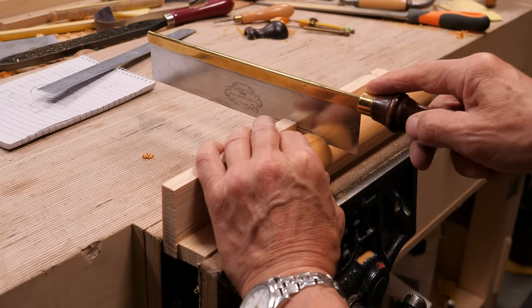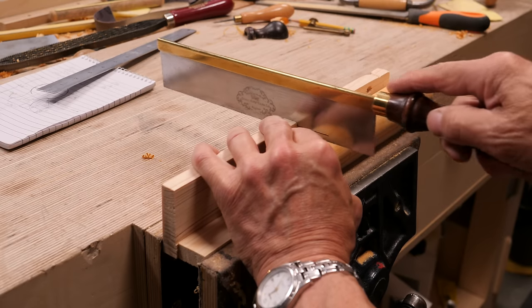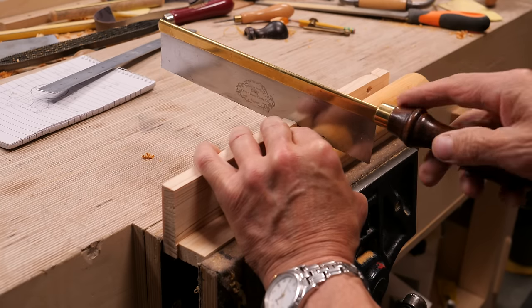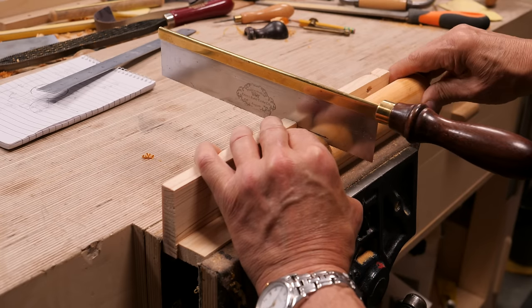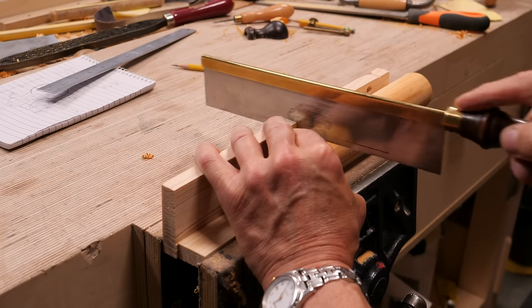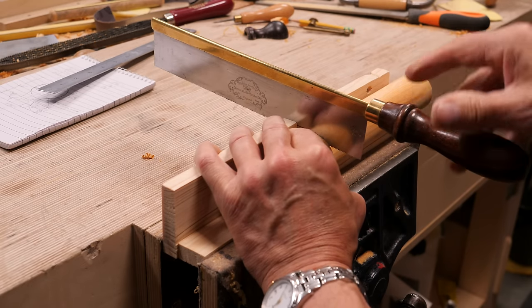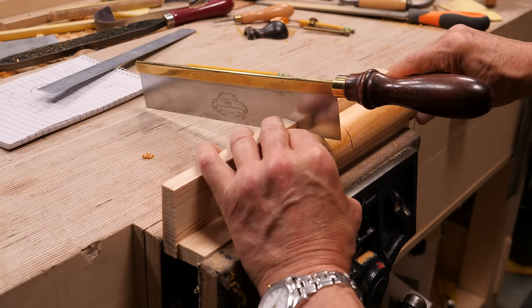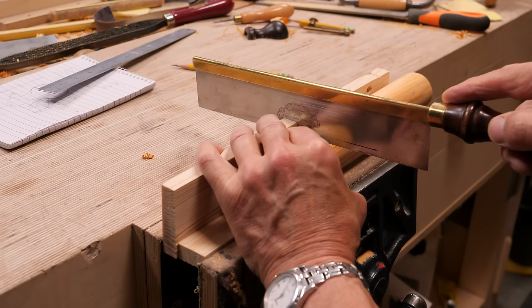Once you've got to there, you just rotate it ever so slightly, like that, and just keep rotating it and taking those small profile cuts like that. And that's going down to an equal depth all the way around, near enough. I mean, it's obviously got flats in because you create a flat with that straight cut.